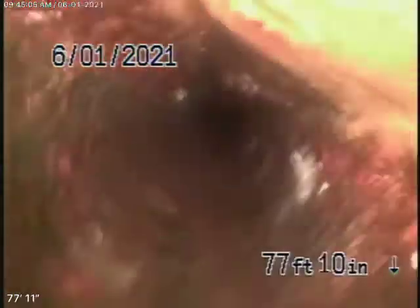Now we're running the camera from the right-hand side of the house here in the wine cellar. There's a clean-out and we're 87 feet in, where we've come to the other clean-out located at the back of the house where the pipe exits. We're going to pull the camera back — cast iron pipe. This looks a little better over here; obviously this is not blocked, but it does have a little bit of rust build-up.